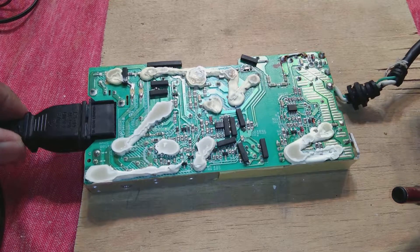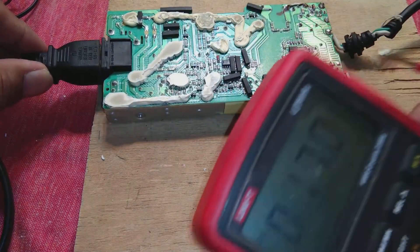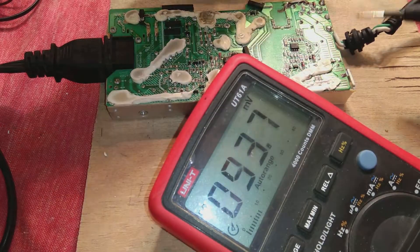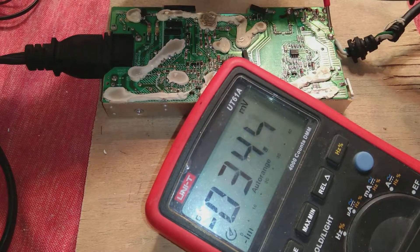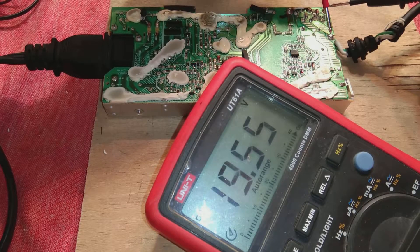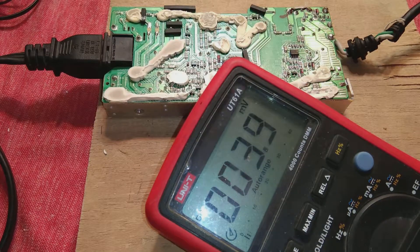A must - you must not short circuit anything. Now you have to put your hand in carefully because it is powered up, so care is required. I'm going to check the voltage on these two points. I put my positive probe on the white wire and the negative probe on the black. You can see 19.6 volts is coming, so it means the cable is defective.